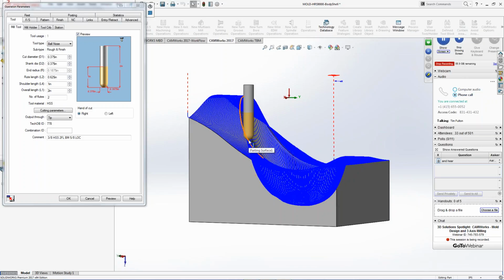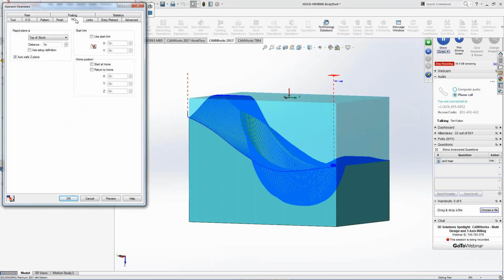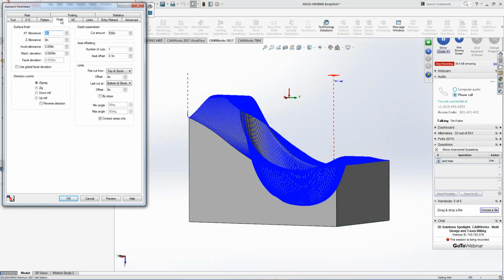And then I can say stop right here, grab a tool change, and then take the larger tool and drop it down to here and get all of this information out of here in the material. And then take the long tool that takes 5 minutes per inch to cut and just take an extra 3 hours and get down and do all the detail work. So you do not have to use the same tool to run the whole entire part. That is really just based off our positioning where we get in to actually do things.